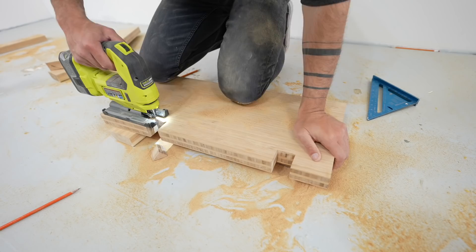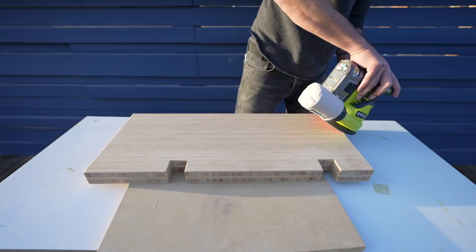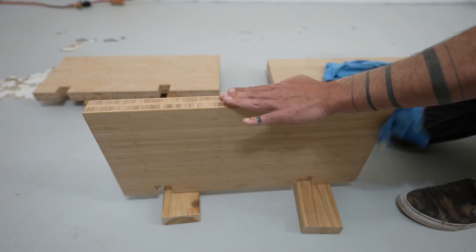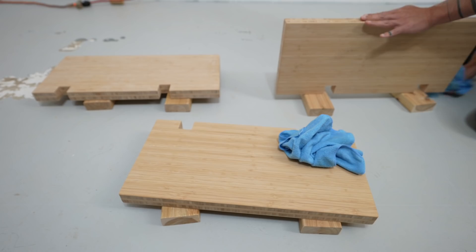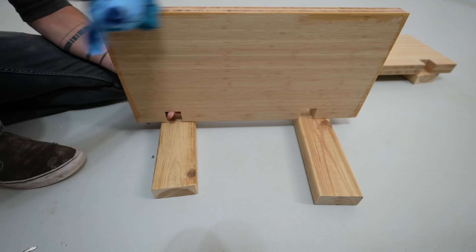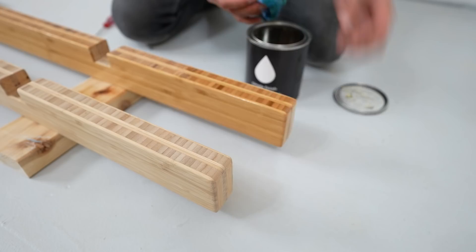The plywood came pretty smooth but I did have to do quite a bit of sanding along the edges and the wood's quite hard. On the edges I started with 100 grit and then worked my way up to 220, and I also gave the side panels a once-over with the 220 grit. I've learned over the years that it's really important to remove all the dust from wood before you apply a finish. I like to use microfiber rags to really wipe them down and get all the dust off, then I added a thick coat of Maker Brand Simple Finish. It's a plant-based oil finish that's fantastic for bringing the color out in the wood — in this case the bamboo — and it has just a little bit of wax in it which offers a durable protective coating. After applying the first heavy coat I let it sit for about 10 minutes and then used a clean rag to rub out the excess.